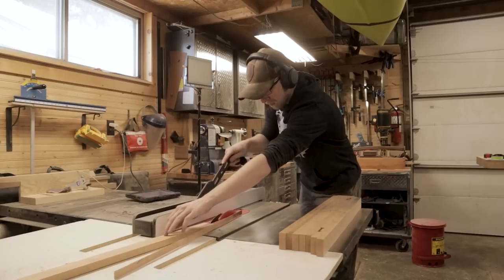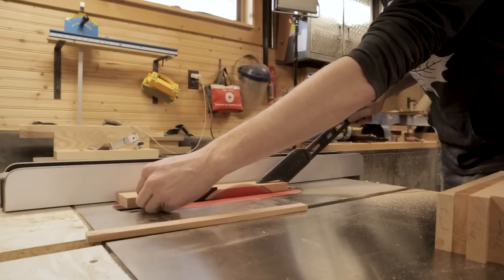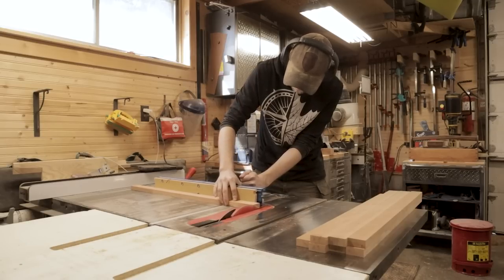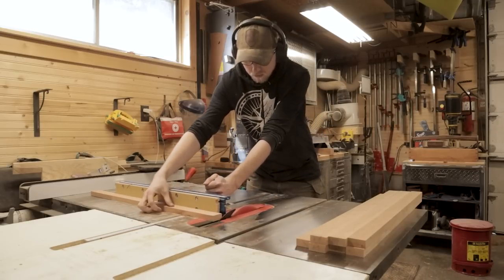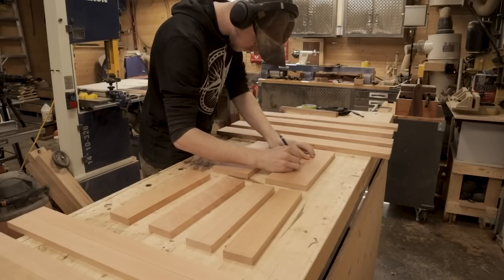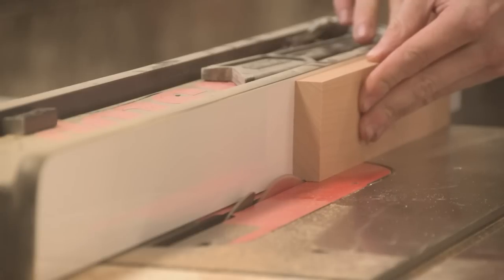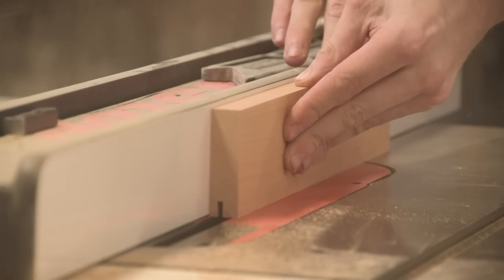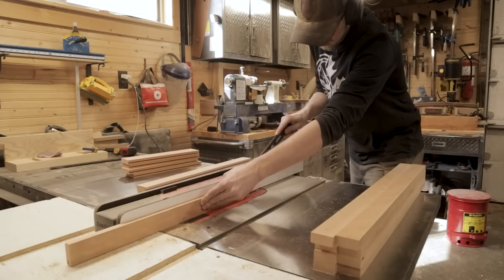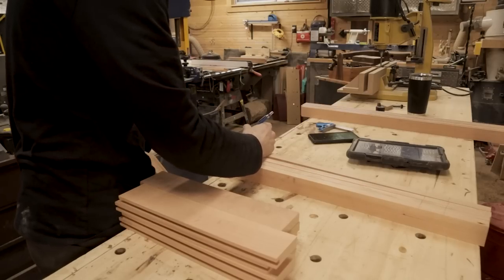What I've done in the past with that step design is I always start by milling all pieces to one single thickness. What I'm doing differently on this project is taking each of my different depths or thicknesses and intentionally milling all pieces to that thickness right from the beginning. The outer leg structure starts at three quarters of an inch, cross stretchers at eleven sixteenths, and the side vertical pieces at five eighths. The challenging part is that you have to intentionally offset your grooves, your joinery, and all that kind of stuff.